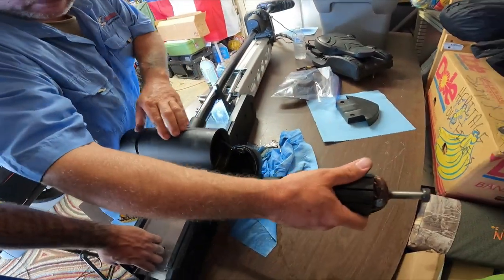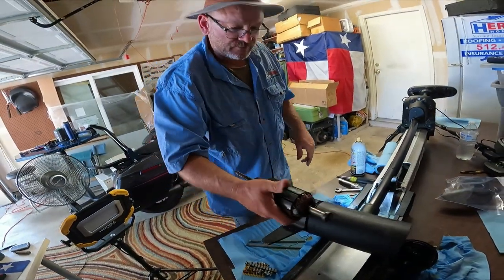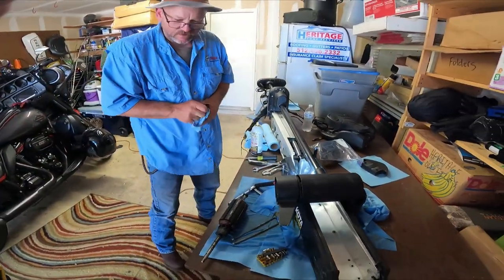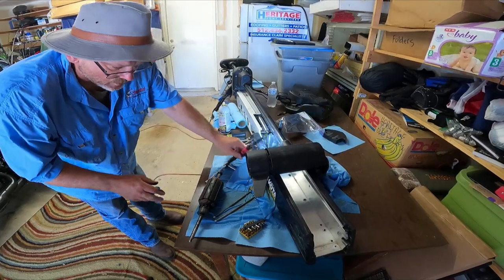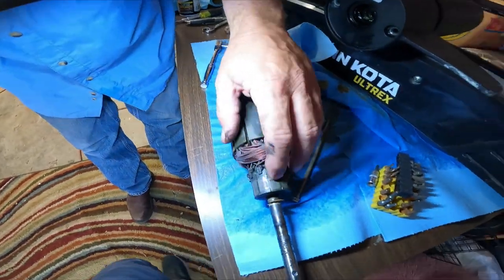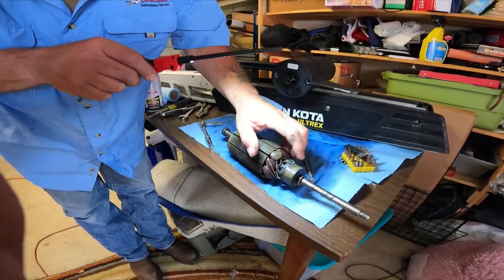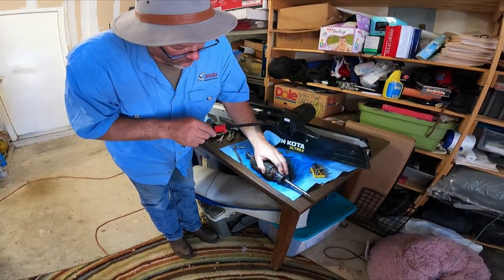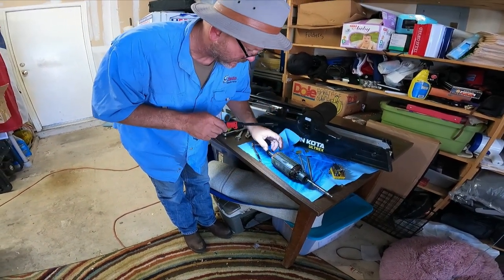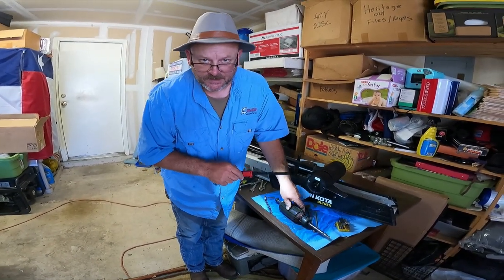It's got permanent magnets, if you wonder what we're fighting here. This had to go through that shaft seal and it's just soaked in water. This is a motor with brushes on it - the brushes run on these right here. This should be nice shiny copper so the brushes can transfer the energy into this. When we rebuild this it will be nice shiny copper again. It's completely rebuildable, what we've found so far. The water in this over time, especially if it was in salt water, this thing would have been a goner.